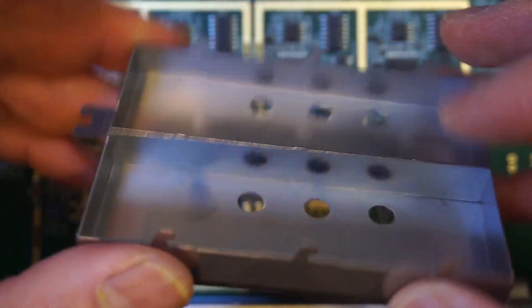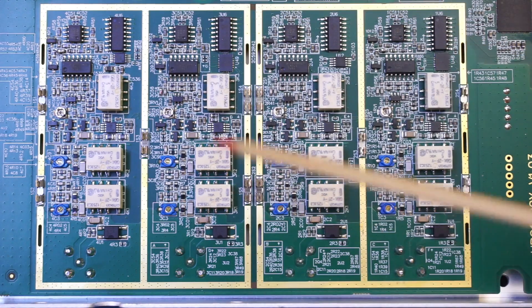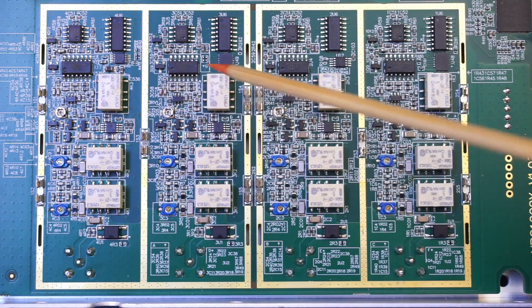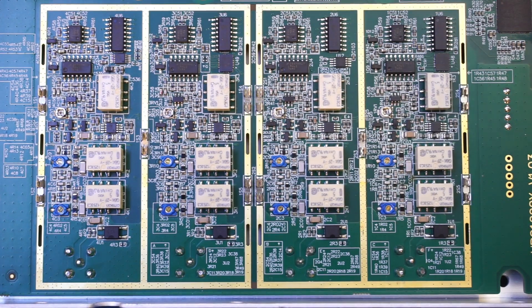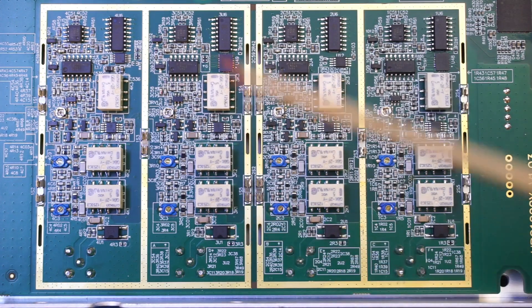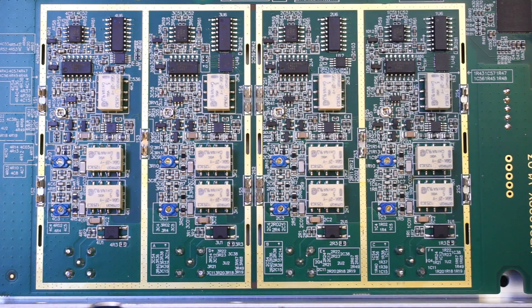If you take a look at the shielding cans, these are not just typical thin flimsy cans — these are very rigid, very high quality shielding cans with slots you can slide in to secure them onto the board. Underneath we have two identical sets. Looking at one channel you can see trim pots and tabs to adjust the input characteristics of each channel, so these are individually calibrated at the factory. There's a solid-state relay plus three additional relays for range switching and AC/DC coupling.